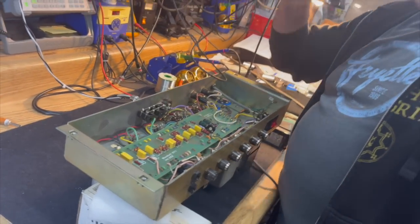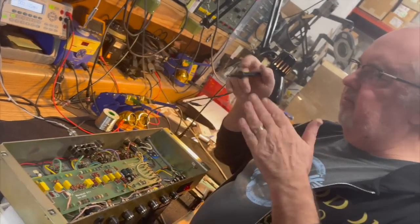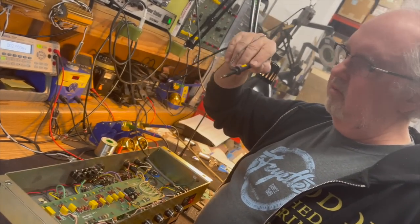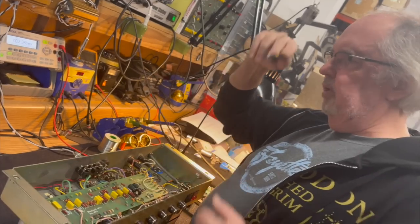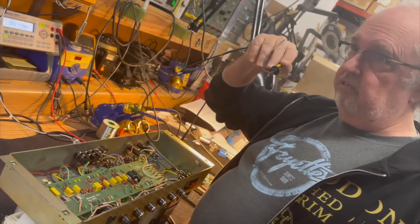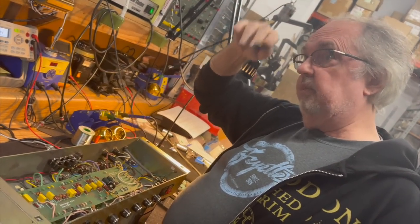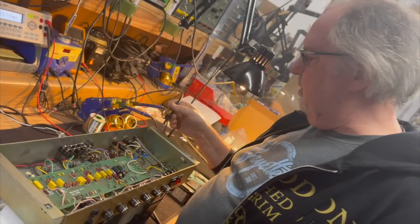When it's AC, it's a sine wave. When it's converted using diodes into DC, it's a series of humps that are all on the positive side of the zero line, as opposed to AC, which has a hump on the positive side and a hump on the negative side. The rectifier bridge changes all those humps to the top side, and then the filter capacitors charge up as those humps grow, and the voltage is depleted out of them at a slower rate, so they don't look like a bunch of humps. They look like a ripple, and that's where the word ripple comes from.